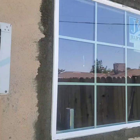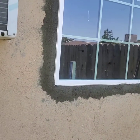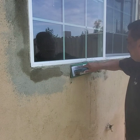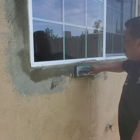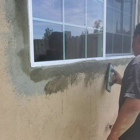There it is — I just finished the brown coat scratch coat. Let that dry for 48 hours, then do the final stucco coat. The very last thing we do is use a soft float and float it in to match your texture. Make sure you feather it down so it blends in when you paint it.